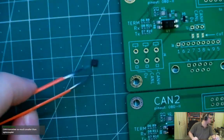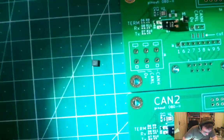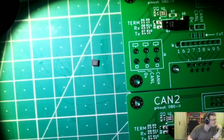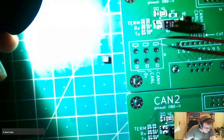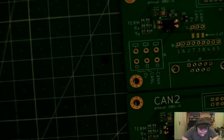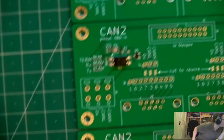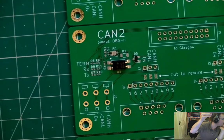I'm not sure if the flashlight is going to help you see, but if I take it away you can see it's basically a square. You can just about make out that something is written on it with the eye, but with the flashlight there's a very definite spot in the corner. I'm going to use that to figure out which way up they go. KiCad uses an extended line — the extended line is up in the top or bottom left corner. Someone shared a screenshot of KiCad footprints where pin one sort of varied quite a bit depending on how you read them.